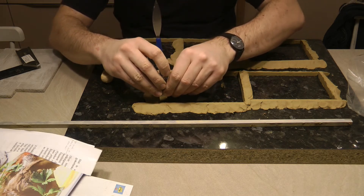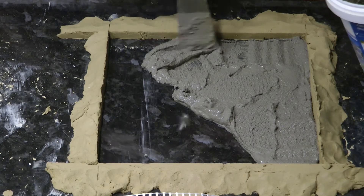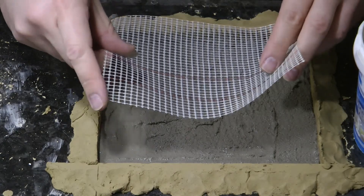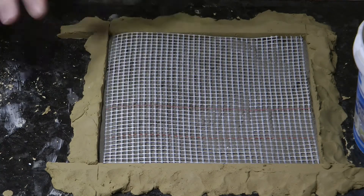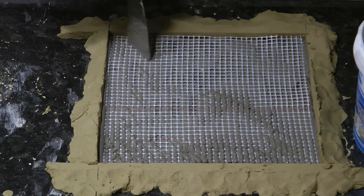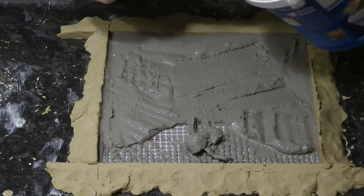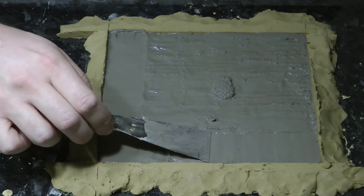Once the mold is done it is time to mix the concrete: one scoop of cement and two scoops of sand, mixed with water to a consistency that is not too watery and not too dry. First I added some concrete to the mold just to cover the bottom, then placed the drywall mesh pre-cut to size. By adding the concrete first, the mesh doesn't sink to the bottom. I added more concrete, tapping it to fill evenly along the sides and corners, then kept adding until it reached the top of the mold. I used a small crafting knife to hand-vibrate the top flush with the mold.